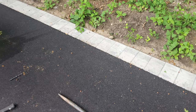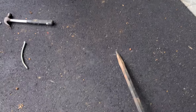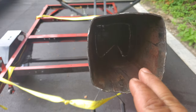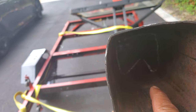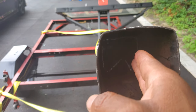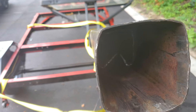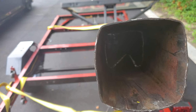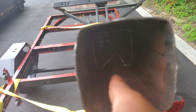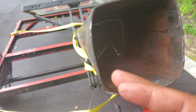What I did was use this heavy bar — it's meant to move earth, like rocks in the ground when you're digging. I used the sharp end and pushed it all the way in and under after making the cut. Mind you, that sleeve is almost six inches deep — it's impossible to reach all the way to the end unless you have a metal-cutting sawzall. Based on the tools I had, I pushed the metal pry bar under the cut and it moved — you can see the wedge it created, which released the tension of the metal all around.